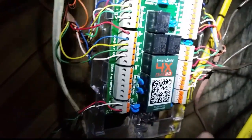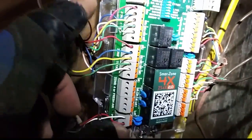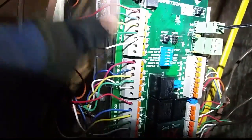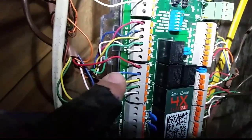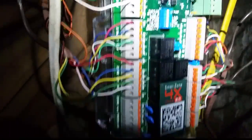Looks like this thermostat is our thermostat. Alright, we have our zone board all wired up — 24-volt power coming in, three dampers here with power open and power close, wire out to the furnace equipment, and our three thermostats. We have our number two identified by our tone inside, and our number one here is the master bedroom. Number three is the kitchen. We're going to hit the dip switches in just a moment, then turn her on and program the thermostats — setting them up for conventional one heat, one cool, and the zone board will decide what to do.